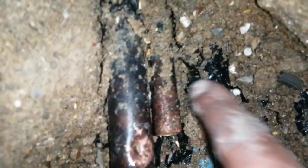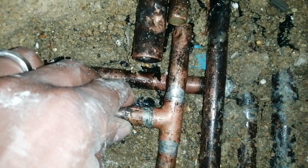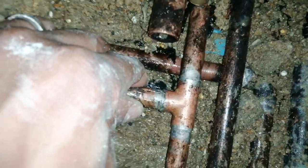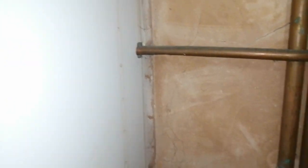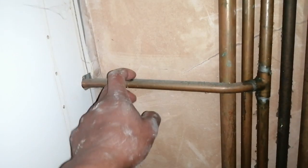They did cover it with some plastic, but the tension on the pipes — this pipe was pressing down on this pipe. There were no crossovers, no pass-overs, it was just forced on like this. I don't see why the pipes couldn't have been run behind the kitchen unit, just as the gas pipe was run by the kitchen unit.